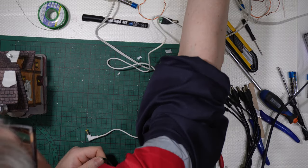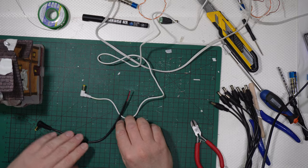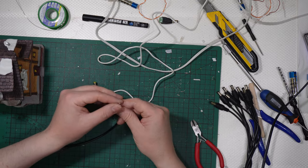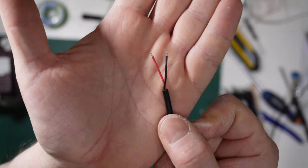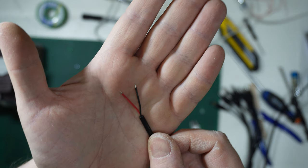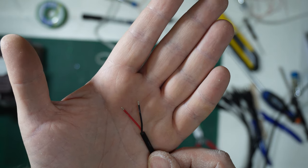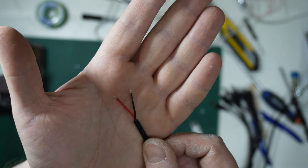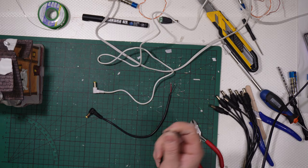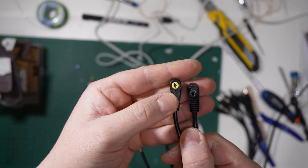They are not white, because white are very difficult to find, but you already have wires, part of the wires that are positive and negative. As you can see, you already have a positive and a negative, and generally they tend to use red as positive and black as negative. Or if you have some other types of wires, you can use the colored one that is not white or not black as positive. I can show you something. Voila, like in this case, they are the same, but in this case, the plug is black and not yellow, but I don't care.